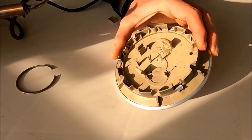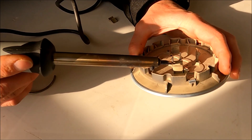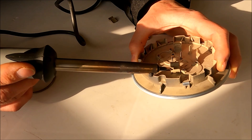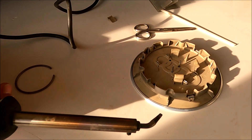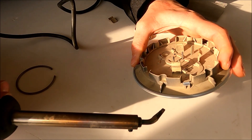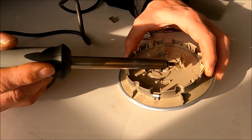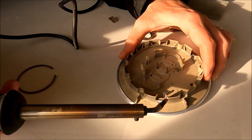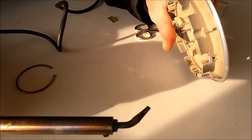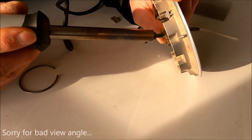Now the other side - this can be a little bit more problematic. I think this part goes inside the center ring of the aluminum wheel, so I will try not to add anything over that area. I will not put any stainless steel reinforcement here, but I will just try to weld where it was broken so it will stay firm. Hopefully the side reinforced with stainless steel will have enough strength to hold it. As you can see it's quite firm already.